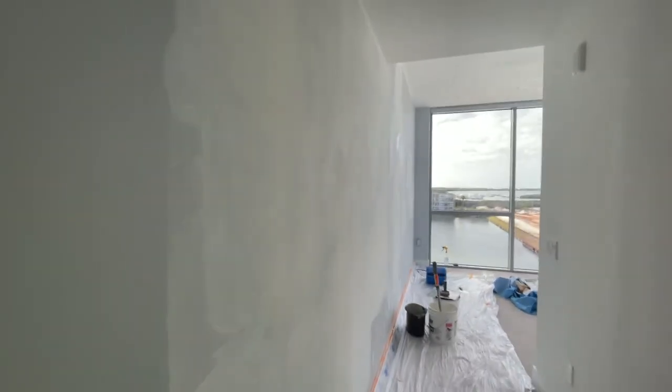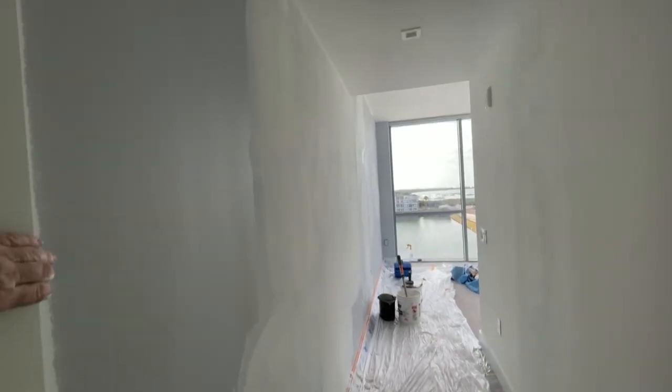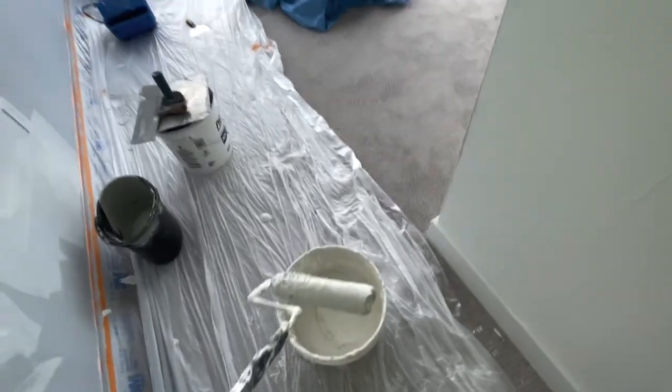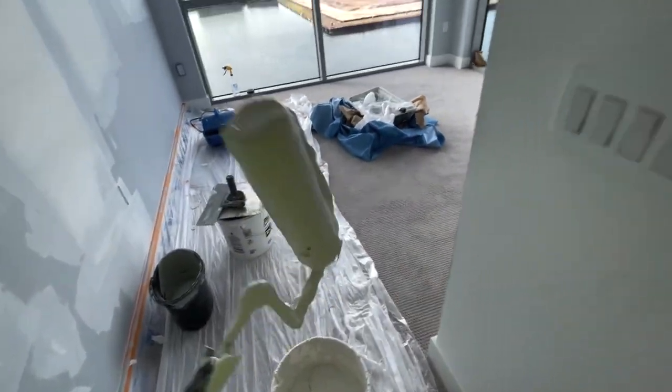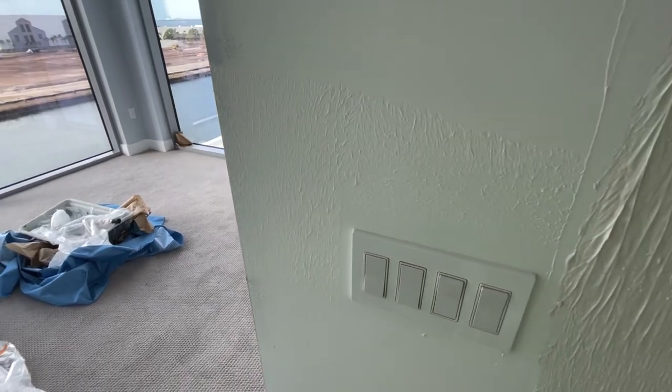And then the primer will tell us, especially with this light, whether or not I have succeeded in accomplishing the removal of the humps, the vertical humps created by the drywall finishers. Just a note on how much mud you should be putting on. I wouldn't roll on any more than this. It's just enough to do this. Look, up and down. 3 feet or so. That's it. If you go too thin, you'll get this and it'll dry on you like it happened to somebody I know.